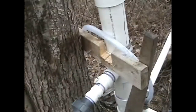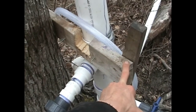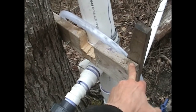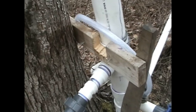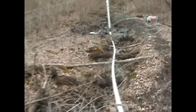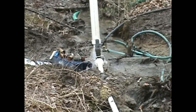You'll notice this was not bumping and moving quite as much before as it is now. I attribute that to full volume and a stronger ram pump pulse, and I think it will equate to a little bit more water delivery. Especially when I sure this up with some better braces and brackets. I'm probably going to pour a concrete mount under the pump now that we've tested it and know it all works well, and give it a nice solid base to operate off of. That should improve our efficiency as well.